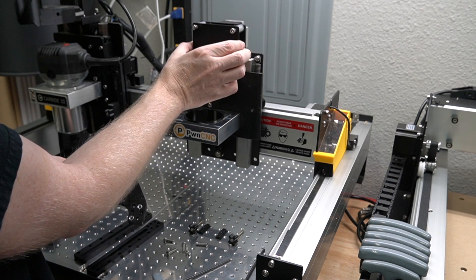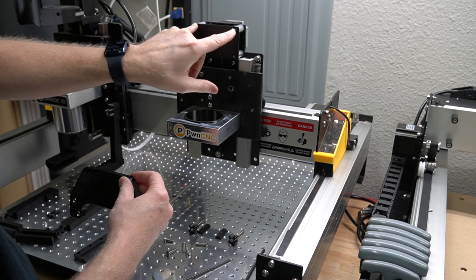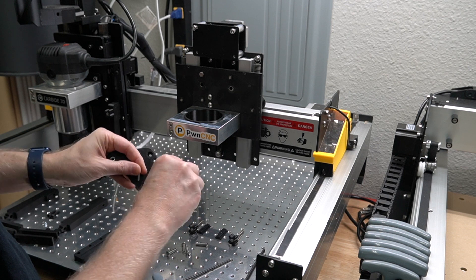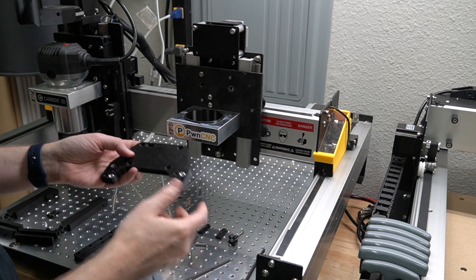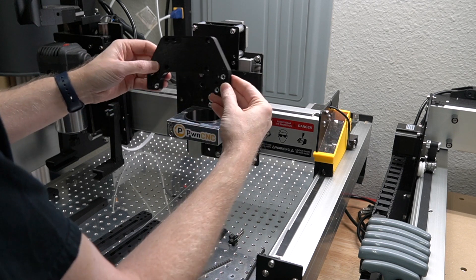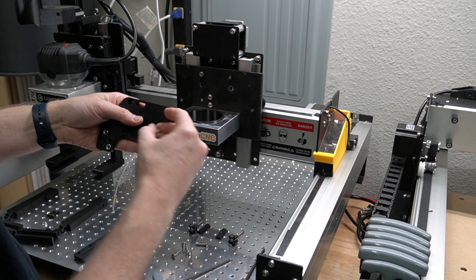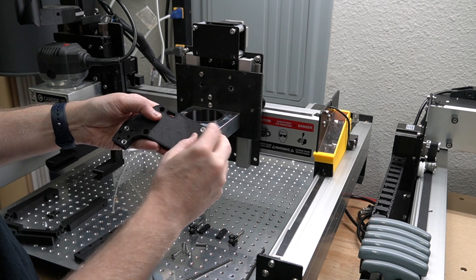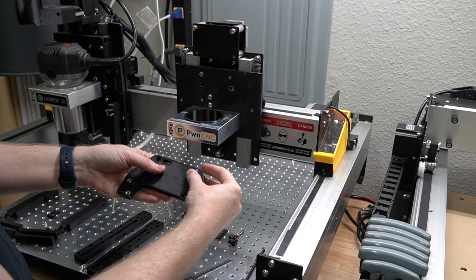Since this is an older machine and I've gotten rid of my original screws, I've just got the two screws up here that came with the kit, as well as two additional screws which we'll use in the bottom section — these two bottom holes right here. You'll notice I've already placed the M5 nuts. The socket head screws should sit flush on the front, which is usually the textured side, and those should be facing towards you.